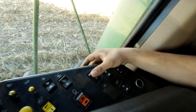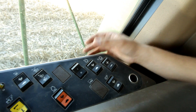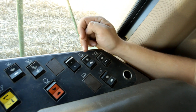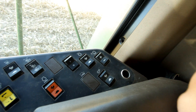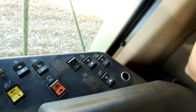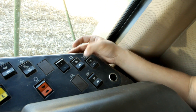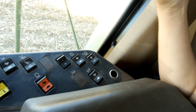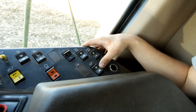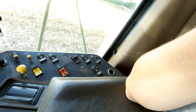Back here, this is a dead switch — that's from previous owners. Here's your cylinder speed, your threshing unit. The crops get taken in from the feeder house and up into the cylinder, and the cylinder is what threshes your crops — your corn, your beans, your oats, whatever you've got. Over here to the right, going along with the cylinder, is your concave width to your cylinder, because every crop is different. And rounding out the list of switches is the fan speed, which blows out all the chaff and junk and whatever else you don't want mixed in with your crop.